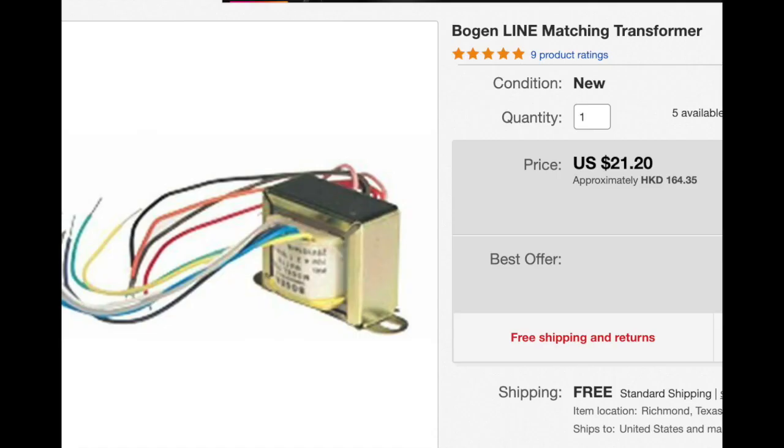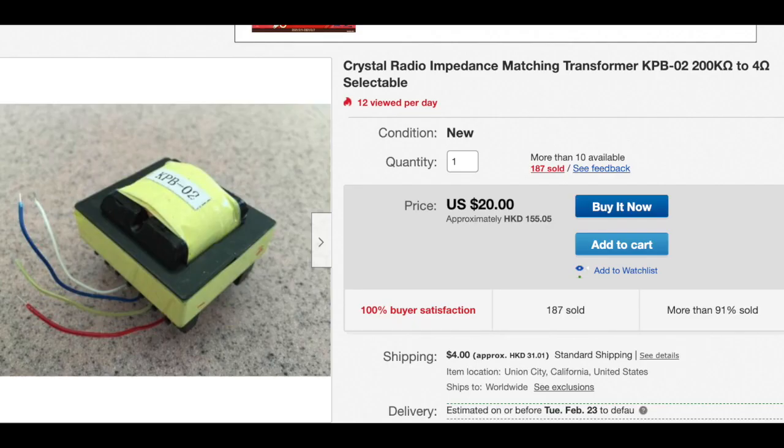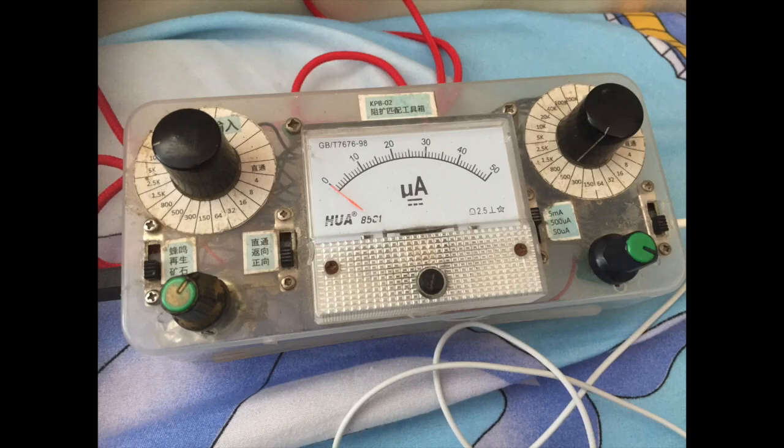At the output end, we can use an impedance matching transformer, or we can find the right headphones that match the impedance of the diode that you choose. The impedance of the diode can vary from 10K if you have a 1SS106, or up to 40K, even 100K, if you have an HSMS2850. It also changes depending on the frequency being tuned to. That's why having an impedance matching box where you can freely change the impedance of the input and the output for audio matching is very important.